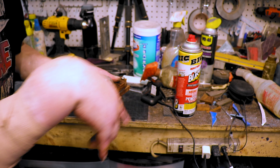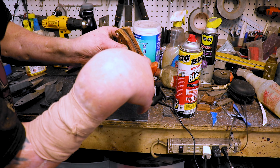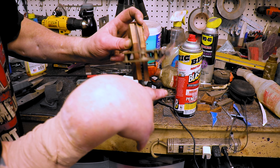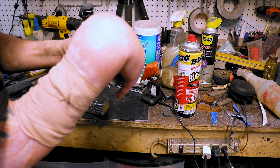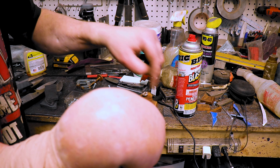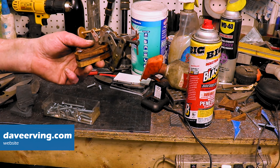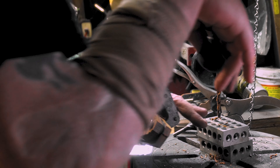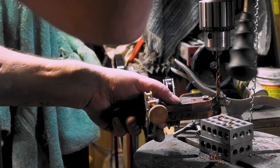Put this up against how we want it. You can put a clamp on it to hold it loosely. I'm checking focus here. I'm not worried about the front sticking over, but I am worried about the back and the butt of it being over. Everything's covering. Clamp one down — that way I'll drill a hole, pull it, put the pin in. It's always good to use two clamps just in case one gets loose.